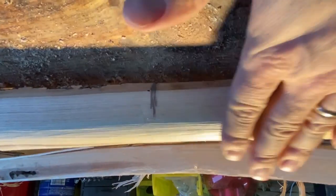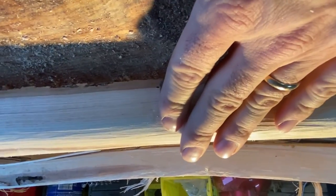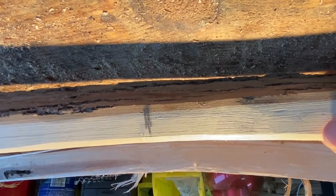You can see, just a few minutes with that rasp, I can take out quite a bit more material here. But I'll show you one that's done. All we want is a half-moon this way, keep the ends square. And then after we bend it, we'll just finish up the bows and shape them so that they fit into the yoke holes.